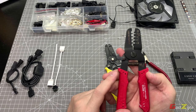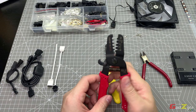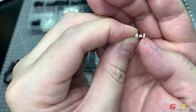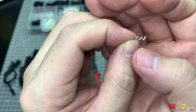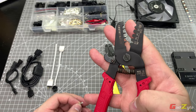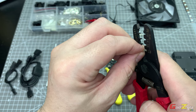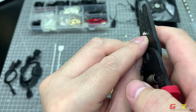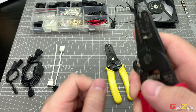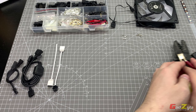What's special about the PA09 is that I have total control over it. Some crimpers will crimp both wings together. Let me show you the pin outs — you can see there's an inner wing and an outer wing in a V-shape. These wings bite your cable. I choose to use single crimping because I have more total control: first I crimp the inner wing, then I go with the outer. This way I won't over-crimp and cut the cables.